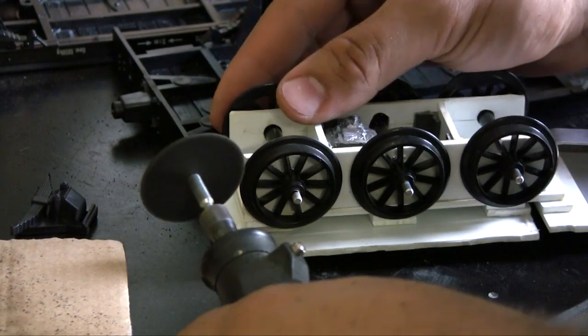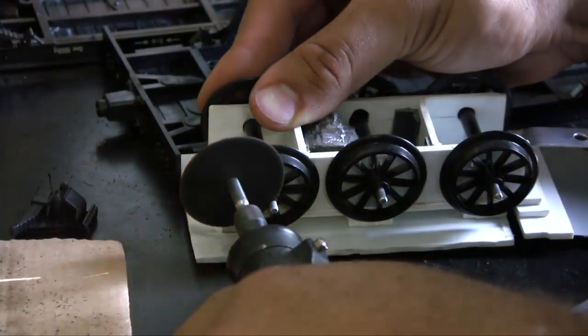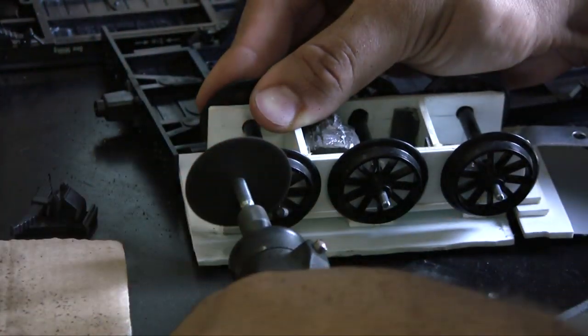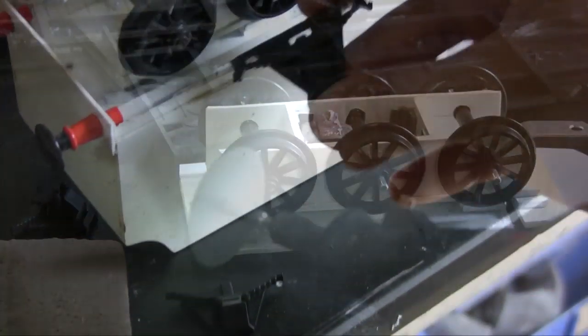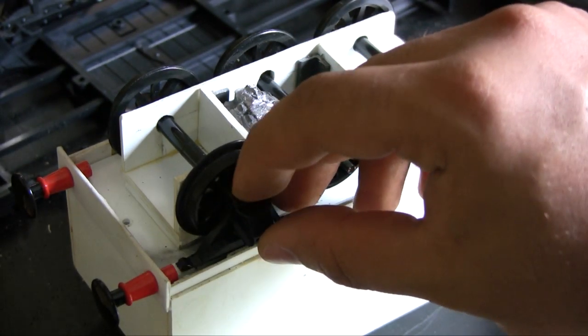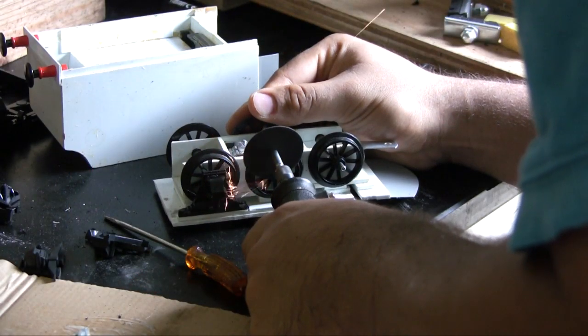The axle ends on the LGB wheels had to be turned into stub ends, again with the help of the rotary cutoff tool. The journal box fit is tested against a newly cut axle. And then the rest of the axles are cut accordingly.